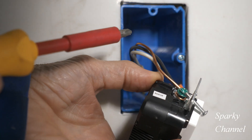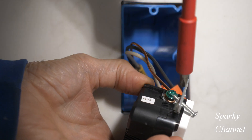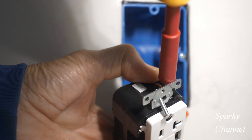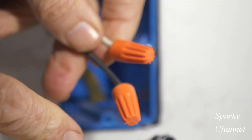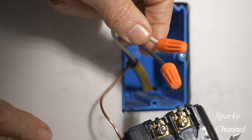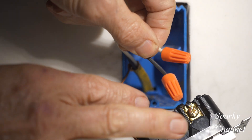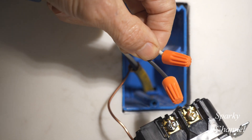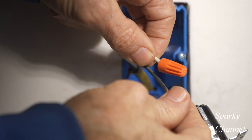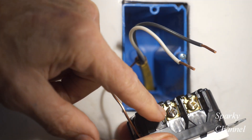To start the installation, I've taken and put the ground wire around the green grounding nut, and I'm going to tighten it down. Notice I put wire nuts in the box prior to installation of the countertop and the backsplash — that's the best way to do it. Just for safety, in case someone accidentally turns the circuit breaker on, you're protected. That's why I have the wire nuts on there.